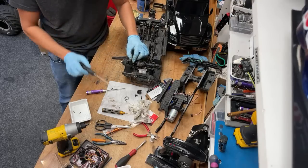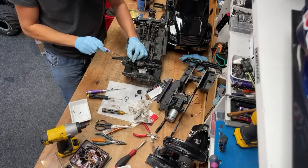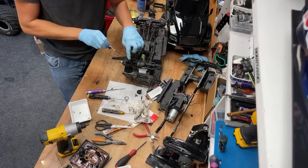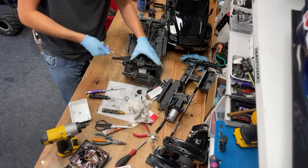And then what does help is if you get an Allen key that's got a ball on the end, then you can do it at an angle. Because normally you'd screw this on first and then put this on after. But because the O-ring's in there, you can't.